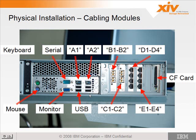The USB connections are used for the USB to serial network. So what happens is the USB port here, there'll be a cable, just like we see on our laptops. It goes to the switches and the UPS. Right, exactly. Now what happens is USB port 1 is used to tie all of the modules together. So this module, let's say this is module 1, and the USB port will actually plug from the USB port on module 1 into the serial port on module 3. So groups of 3. And remember the groups of 3 diagram?